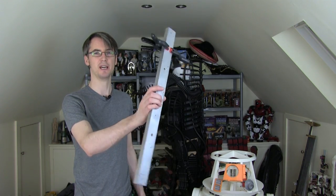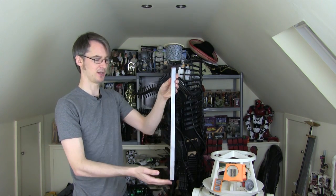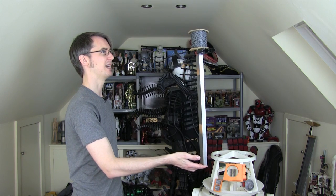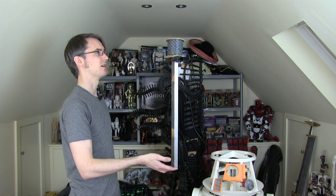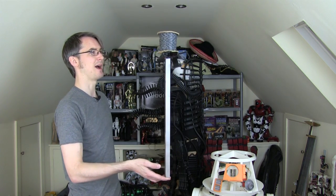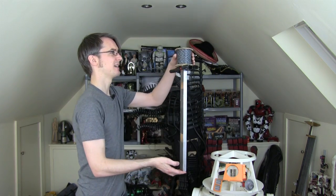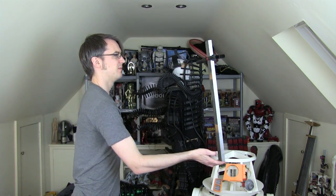Let's talk about how things balance. I've got a piece of wood here, which is quite a lightweight piece of wood. I've got two clamps attached, and that's how I can put this reel of cable on top, which is actually fairly heavy. I'm going to balance that on my fingers. And what we find is it's actually quite easy to balance. I can stay almost stationary, and I only have to move my hand a little bit just to compensate. The reason for that is that the mass on top needs a larger force to move it - it has quite a large inertia. So it doesn't want to move too quick. This stick is about the same height as my polystyrene ball, and my reel of cable is slightly lighter than the robot is gonna be. So if the weight is bigger, it'll be even easier to balance. Now if I take the cable reel off, I can still balance it, but it's quite a bit harder because it moves quite a lot quicker.